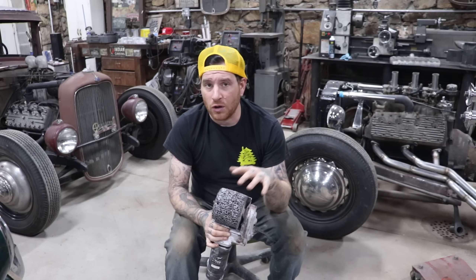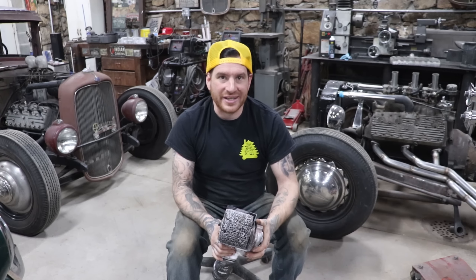The other drums available go all the way from a flap disc Scotch-Brite type mix up to a sanding drum. When we were doing the frame on the Sweetheart Roadster, after all the welding and repair work, we took the expander wheel with a sanding band on it and were able to go over it to knock down all the welds and give it a nice, fresh, even, consistent finish. Then we came back with some of the other drums to smooth it out and remove the sanding scratches.